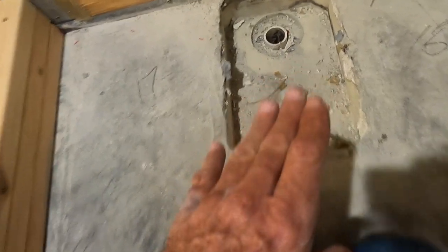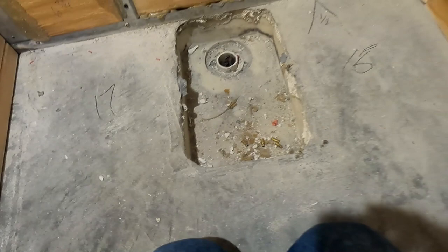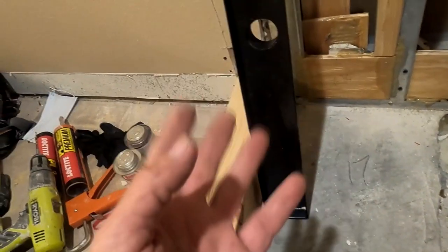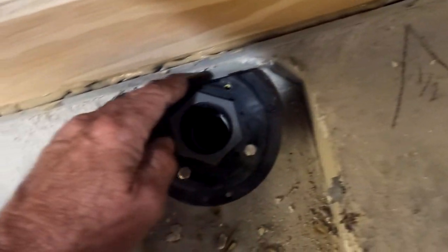When the tub was here, I sheared off the pipe as far as I can go. There's a three-inch pipe embedded in concrete, so I can't get any more depth anyway. Because we couldn't do a center drain and a large square drain wouldn't fit in the available space, we decided to go with a linear drain right here. We can't bump it out because by the time you put in two 90-degree fittings to get it away from the wall, you have no room for the drain. This drain is specifically used with a three-piece drain kit, which has been sheared on the side to fit, and it still doesn't quite fit — there's about half an inch of room along here.